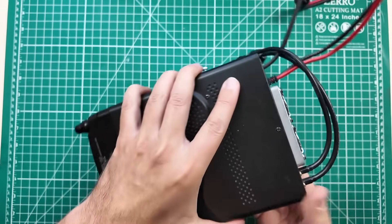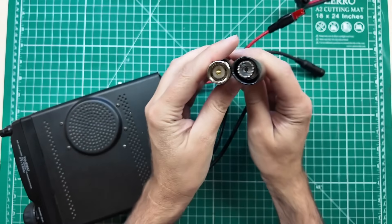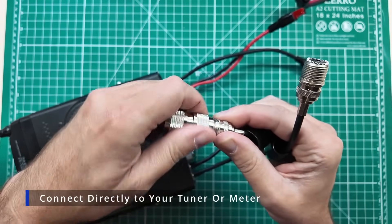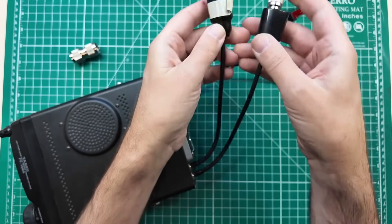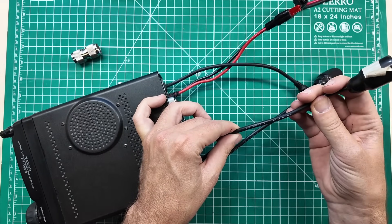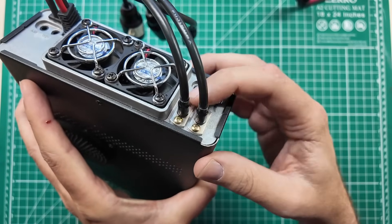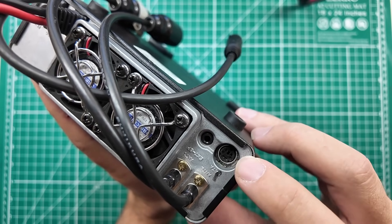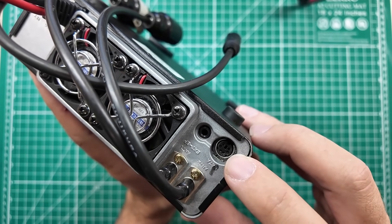Those revisions include some filters. First off, it has these really weird antenna connections on the backside. Instead of having regular SO239 ports like every other radio, it has these guys here on coax cables. This is RG58 for both cables, and they just go straight into the radio right there. Below that, you've got a data connection, which is the six-pin mini DIN style, like your old PS2 keyboards. And this is the same on a lot of radios from a lot of different brands, and I'm really happy to see that here.